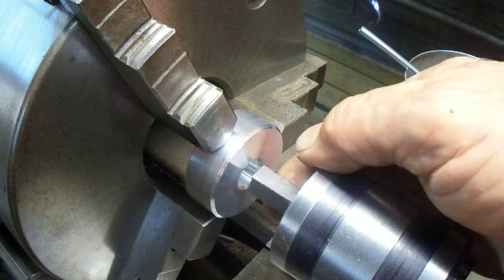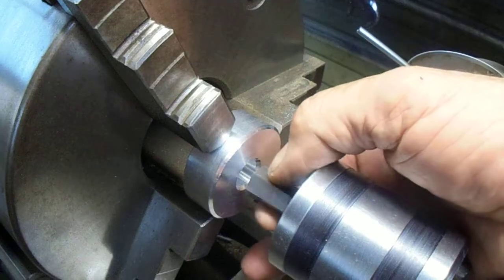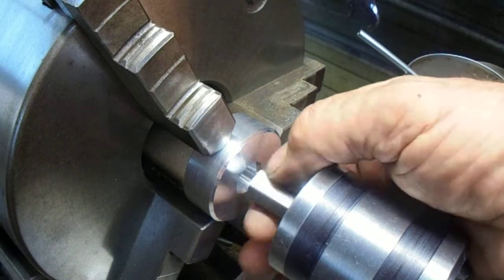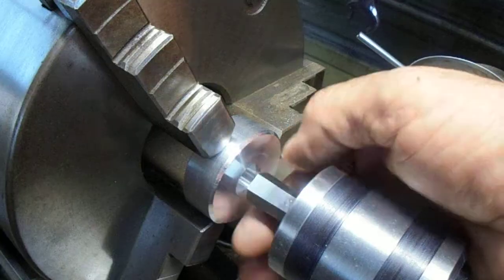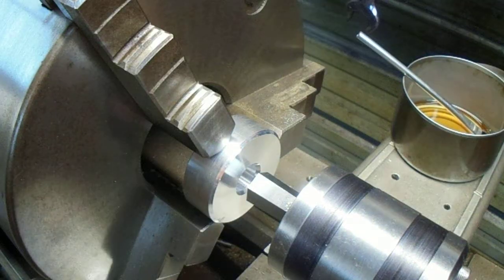This broach is 9/16 inch in diameter. I made it a few thousandths over — about 8 thousandths larger in diameter — to give a little clearance for resharpening purposes, so it can broach a few holes before it needs regrinding. We'll see how this thing works.